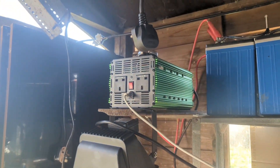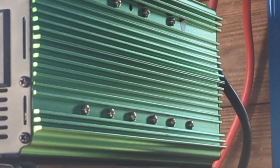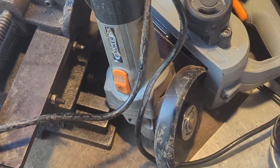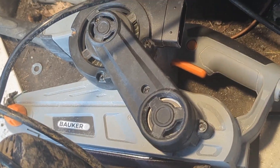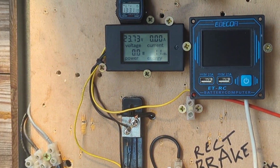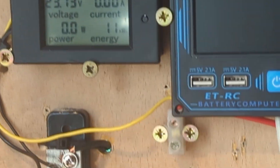The inverter did its job — I can just load it up with a 500 watt light. In the videos you'll see I was running a 750 watt grinder for a bit and a 920 watt belt sander. Sorry, I got disturbed by a phone call and completely lost my way, but the batteries you can see are sitting on 23.73, so that isn't too bad.